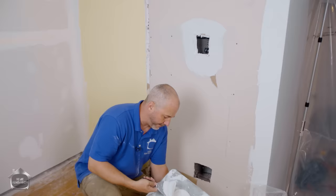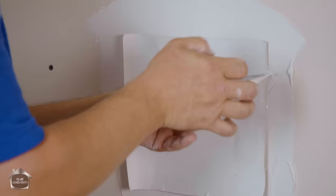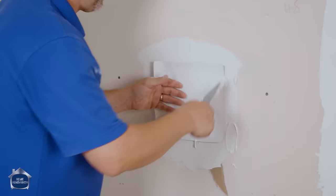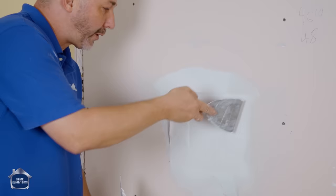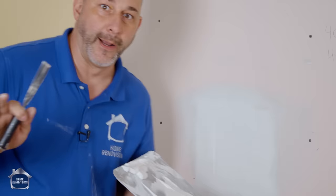Put a little bit on the inside edges of the patch as well and press it in. If you find it not going in all the way and there's a little restriction, just use your knife to level off the corners, then press the tape in. You're just embedding the drywall tape, and you want to do this just once. If you work it too much it's going to wrinkle because of the moisture and cause all kinds of pain. So get it in, wipe off the extra mud, and walk away.